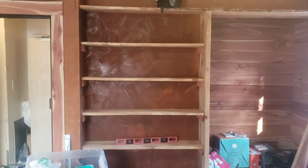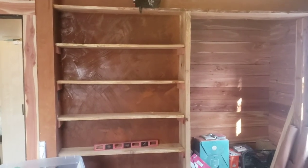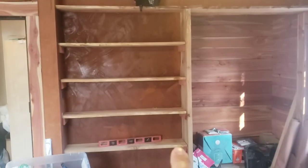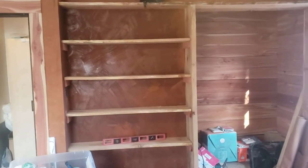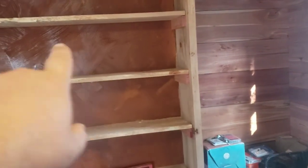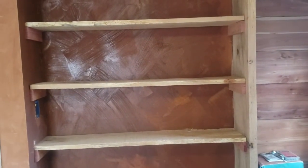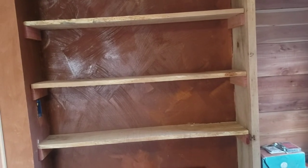Now it's time to cut some boards and build a shelf. The shelf isn't quite done and it doesn't look level on camera, but it was level with a level. The easiest approach was to put up some cleats — those are cedar. Everything else is some leftover oak that a buddy gave me. It wasn't properly dried and oak is bad about warping — the thick piece shouldn't warp too bad, but the thinner pieces aren't fully dry so they're liable to cup, so I just have them brad-nailed or finish-nailed down.